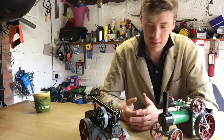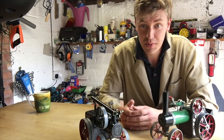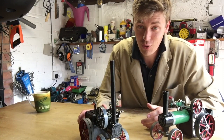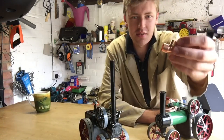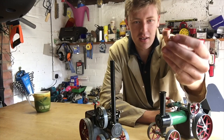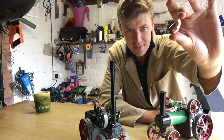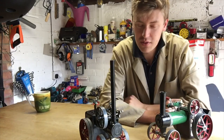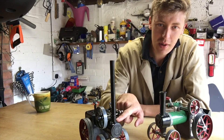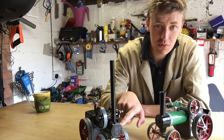So how do you overcome this? Well, very hard to make hinges that small, especially when you don't really have the equipment to do it. And then this little strike of genius: I took one of these 90-degree 12mm copper pipe bends and I cut one of the end flanges off. But the other flange I just glued with JB Weld onto a short piece of 12mm copper pipe, which I'd already glued into the smoke box. And the finished result looked like this.